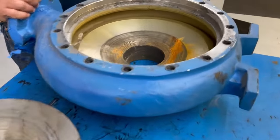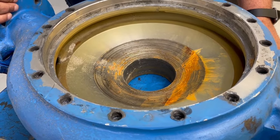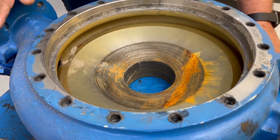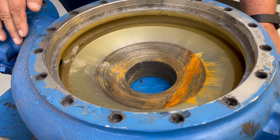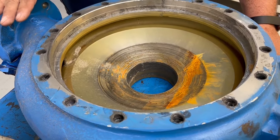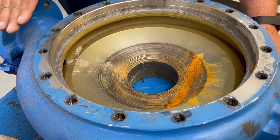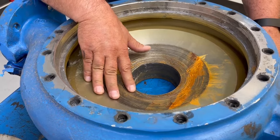The third example is a casing. This particular casing was set with standard clearances — about eight thousandths, as we stated earlier. However, the actual operating temperature in the process was over 300 degrees, so the impeller was set closer to the casing than the O&M manual recommends. Therefore, we had impeller-to-casing contact, and this has significant wear on it.